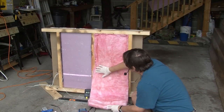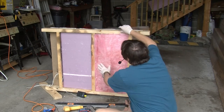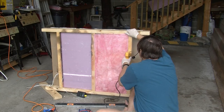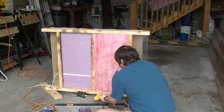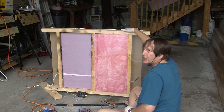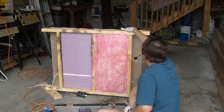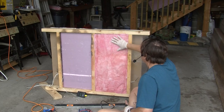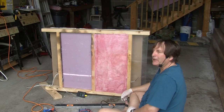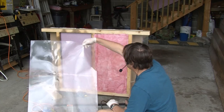Now we'll put in our layer of fiberglass in front of this panel. As in the previous tests, we'll use these old plastic sheets to keep the fiberglass in place and also to restrict the airflow much like it would in a typical wall — it's a 2x4 stud wall. The outside, which is the back, would normally be concrete, then the layer of rigid foam, then the layer of fiberglass, and then on top here would be a layer of drywall, except we're using plastic so we can see what's going on.